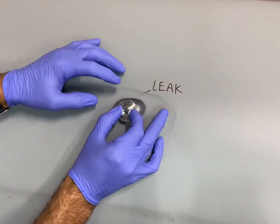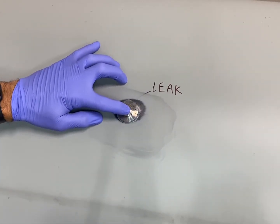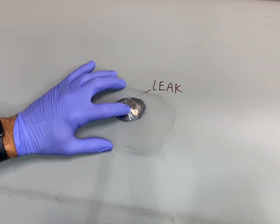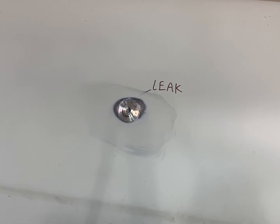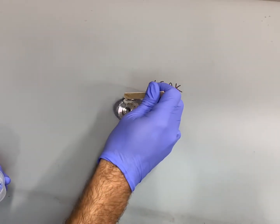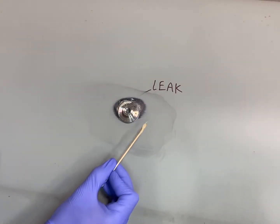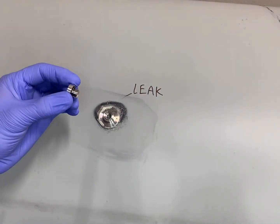Once you have it nicely coated, go ahead and press the disc onto the leak, centering it as best you can so the leak aligns with the middle of the part. That way it can still off-gas and there are no leaks created between the epoxy and the part — it all leaks up through the threaded hole where the bolt will be sealed. Depending on the surface orientation, you may need to hold the Pinhold down for about 10 to 15 seconds to get a good hold. Then take the extra epoxy and run it along the outer edges, smoothing it out as best you can to get a nice sealed finish.